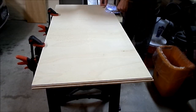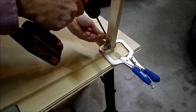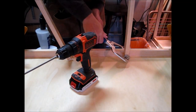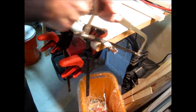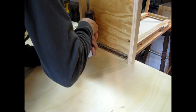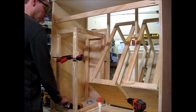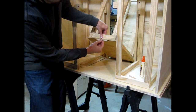The cabinet was made from three-quarter-inch plywood. I also used 1x2 pine for the face frame. To attach the bins to the cabinet, I used continuous hinges and then cut those to length. I attached stop blocks to the frame, and also added small spacers at the bottom of the bins to make sure the front would align with the cabinet.